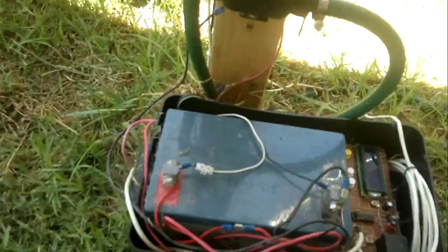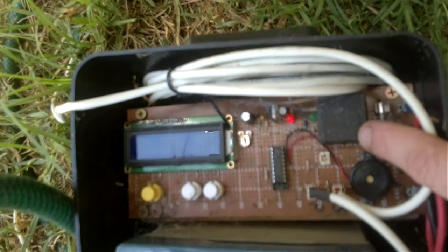The controller is in here with a 12 volt battery. The controller switches using a horn relay. Not sure if you can see the screen but it's got the spa temperature, panel temperature, and battery voltage. I actually built this — it's not something you buy off the shelf, but I can set the maximum temp for the spa. I've got it set to 38 and it's actually gone to 39 but that's just because of the difference in the sensors. The start differential is set for 20, so the panels have to be 20 degrees hotter than the spa before the pump kicks in, and it pumps down until it gets to 10 degrees hotter.